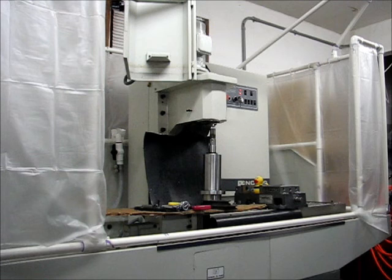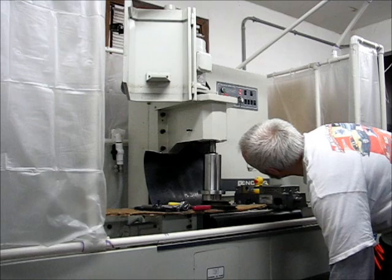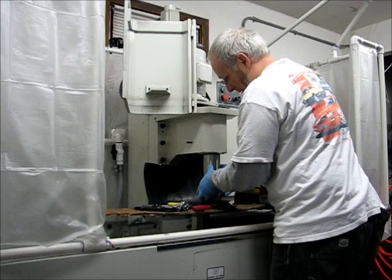Sorry, I have the spindle cartridge, and then I'm going to lower the mill head down on it so that it gets close to the position where it needs to be aligned. I've got it set up so that nothing is scraping the inside of the bore. So now I'll position it a little bit better by actually loading it into the mill.